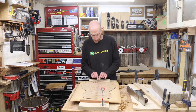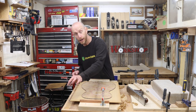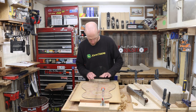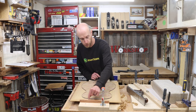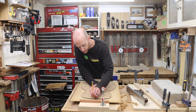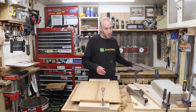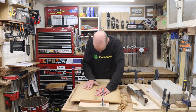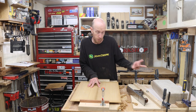This end of the board has a few little chips on the end — that's not going to affect anything since it'll get cut off, but I want to make sure I have some good material for the back strip. So I'm going to shift my template back down toward the bottom that way I don't have to deal with the chipped area, and I can take my strip for the back strip off of the top. This one joins so nicely I don't even think I need to sand it in — it looks perfect. All we need to do is cut a slight taper on the sides and we're ready to glue this one up.